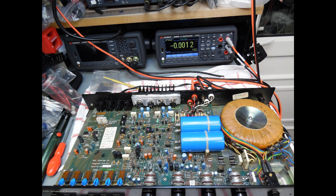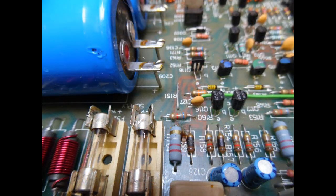Associated with the input selector switches you can see there's a filter switch, tuned to 7.5 kHz. The thinking behind this is if you connect a radio or tape player, this 7.5 kHz filter can be selected to reduce the overall noise, which beats having to turn down the treble control to compensate. You also have a mono selection button — rather than the two channels being processed separately, the two channels get mixed together instead of being separately amplified.